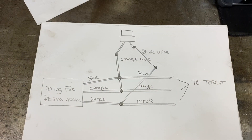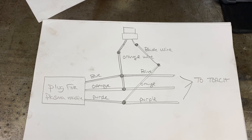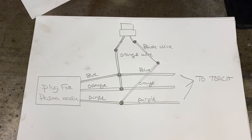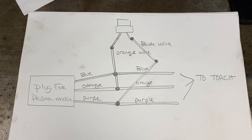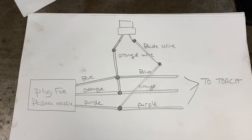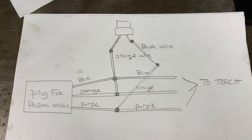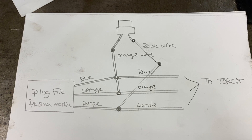You can see the little schematic I made. Basically on the input side — the part that goes into the plasma cutter itself — I took the blue and orange wire, spliced into them, and put my own orange wire on them. Then I spliced into the purple wire and put the black wire onto that. Those two wires are attached to my switch. On the schematic you can see the input blue, orange, and purple. Those wires still go to the torch, but the blue and orange connect together to one wire of the switch, and the purple cable to the other wire of the switch.